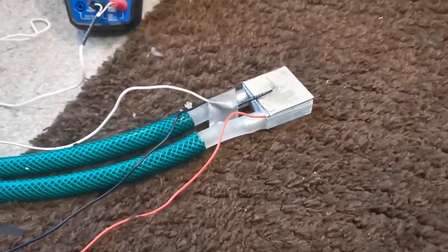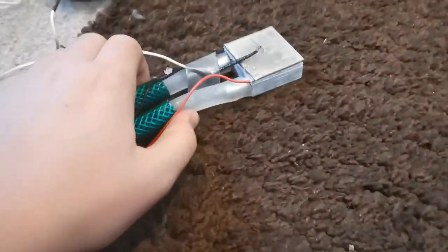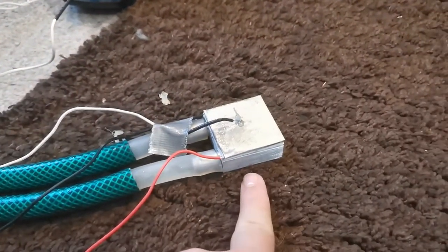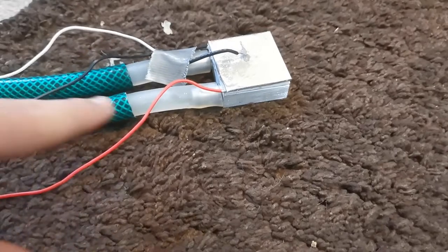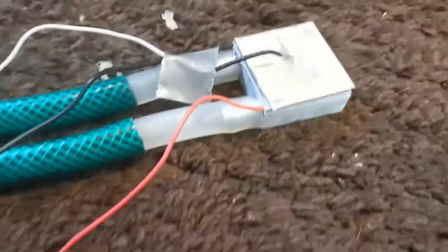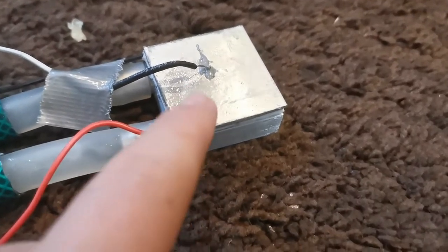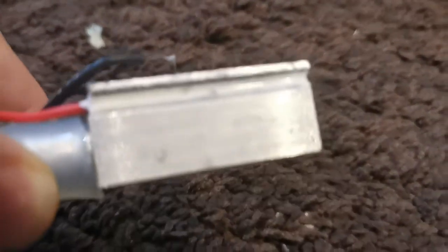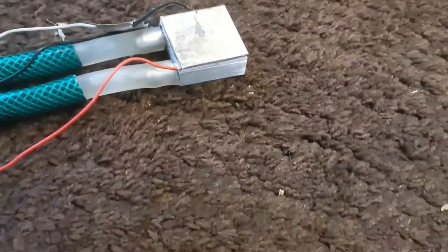This is a video on this little air conditioner I've made. It's a special scientific sandwich. On the bottom there's a little water block — that's what the two water tubes connect to. Water comes in, takes the heat away, and sends it back out. On the top there's a little sheet of aluminium plate, which just gives you a surface. In the middle there is a thermoelectric cooler, or Peltier module.